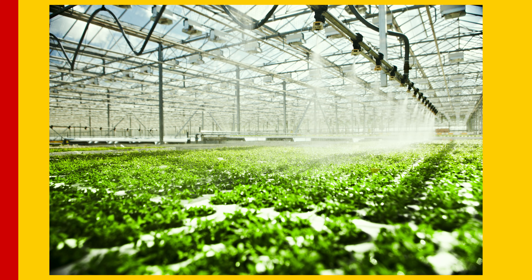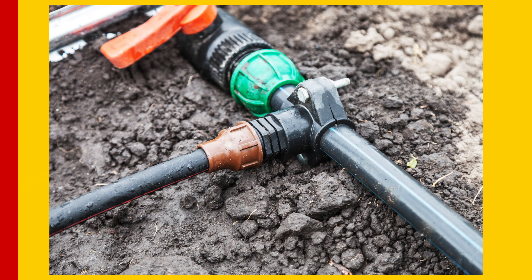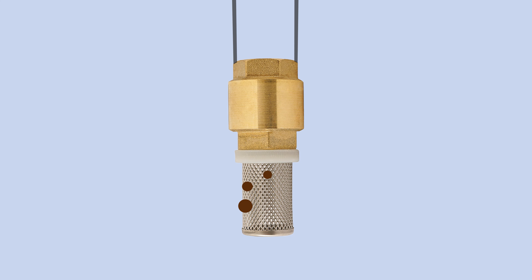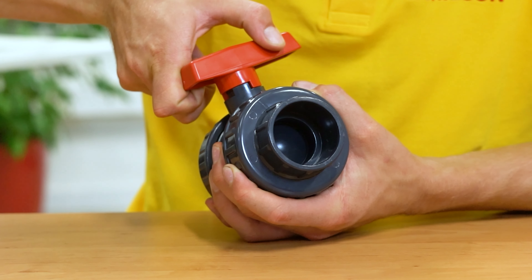Water line ball valves are typically made out of brass to add durability. For irrigation systems, ball valves help control water flow, and when it comes to maintenance, they can isolate certain parts of a system to make things easier. They also play a big role in maintaining water pressure and preventing backflow. One important point is that when water is dirty, the ball valve may become clogged, resulting in possible leakage or unreliable operation. To avoid this, you can install a filter on the supply side. These valves are typically made out of PVC since they are typically buried and protected.